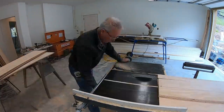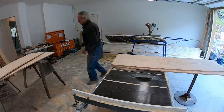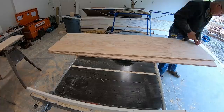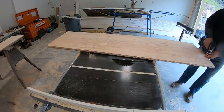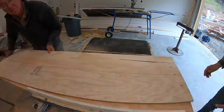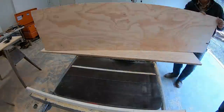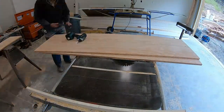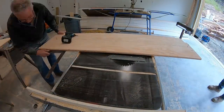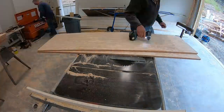The shape and proportion was figured out by studying other houses in books, online, and around town, and then by mocking one or two up with scraps and tweaking the design until it was right. The material was three-quarter inch sanded shop plywood. Around here, sanded shop is a grade designation for plywood that started out in manufacturing to have a clear face, but ends up with some sort of a blemish — or a blow, as it's called. The result is a non-graded, non-structural sheet that is way less expensive but has some defect. It worked perfectly for this because I could cut out the problems.